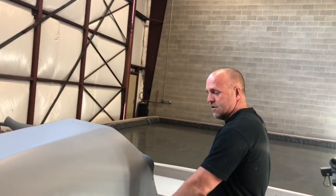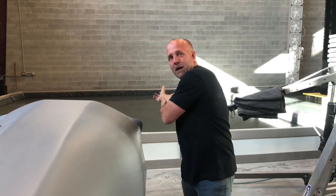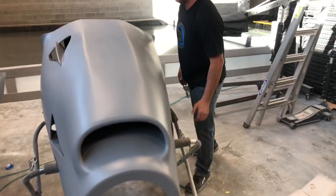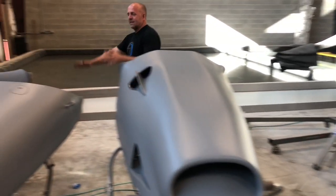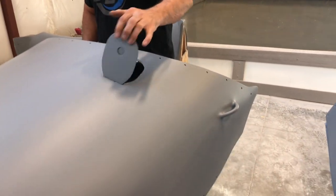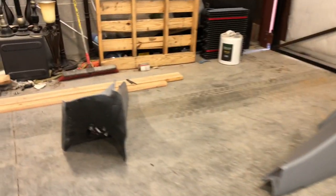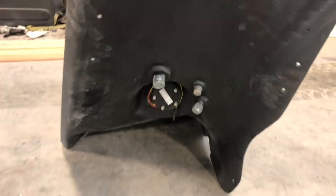These are two traditional fresh-air vent NACAs. On a piston engine you'd normally see the NACAs further back, but on a turbine the exhaust pipes are up front, so all the NACAs have to be forward of the exhaust pipes — otherwise you get turbine smell coming in. The top cowling is done, I've got a simple quick glass door installed, my gear leg fairings are in, and over there I've got my gear leg fuel tank to figure out next.